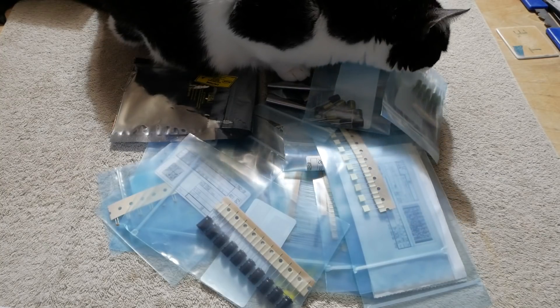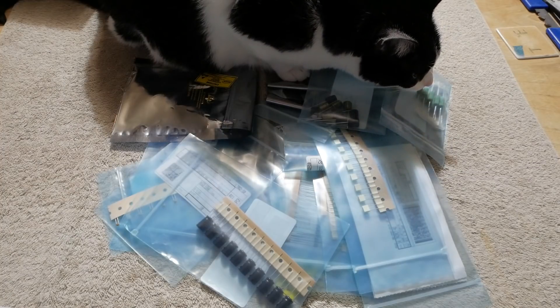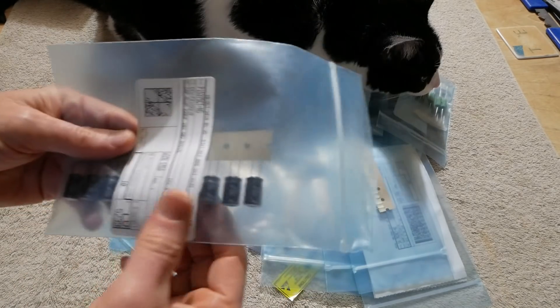Getting the amplifier up and running with first prototypes — I think that will happen before the end of the year. The next video I'm going to do in this series will be the output stage and the voltage amplification. Those stages kind of work together, so I'll probably put them in one video, though my videos end up being long so I might break it into a couple. Once we get that done, I can start building a prototype and talking about negative feedback and the compensation that has to be done with the amplifier.